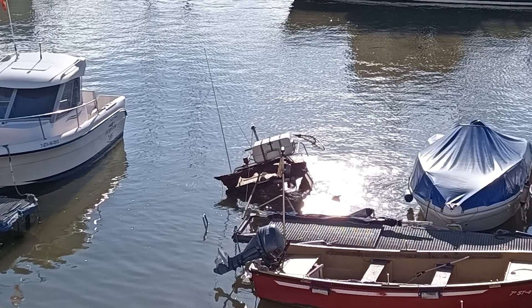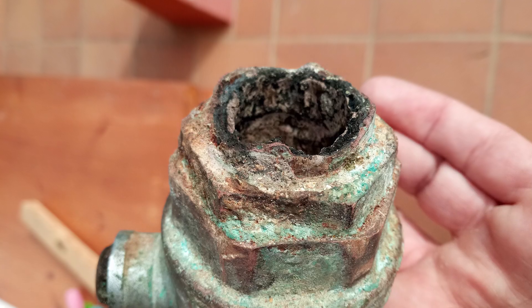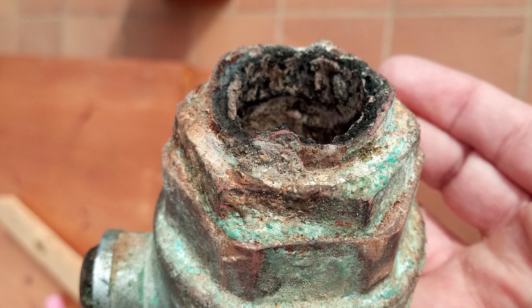A boat can sink if it takes on water through the hatches in very rough seas, or because rainwater gets inside and we neglect it for some time. The most common cause is a leak below the waterline, usually after a collision that can open a leak, or more commonly due to a mechanical failure that causes a pipe or a through-hull fitting to break or loosen around the propeller shaft. My advice is to check sea cocks when your boat is out of the water — I learned this the hard way when I ended up holding the toilet through-hull fitting in my hand the first time I took the boat out. Don't start banging on them to check if they're okay while you're in the water or you might mess up big time.